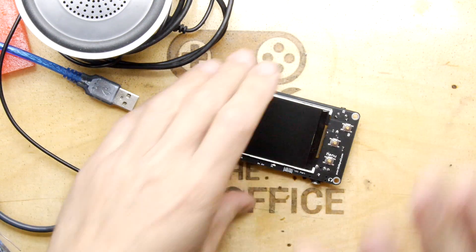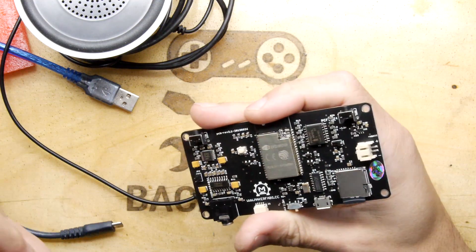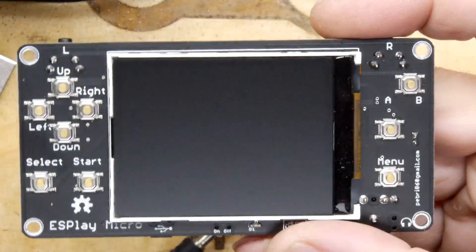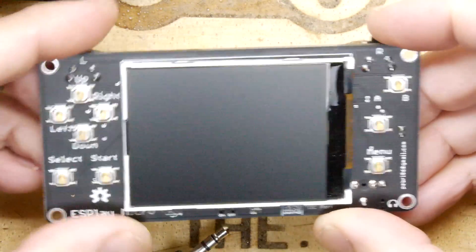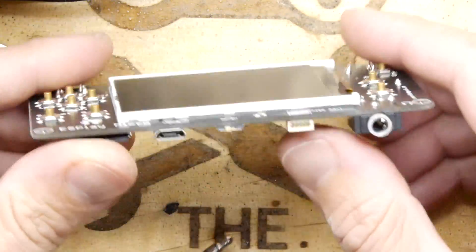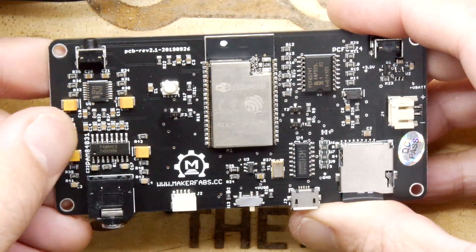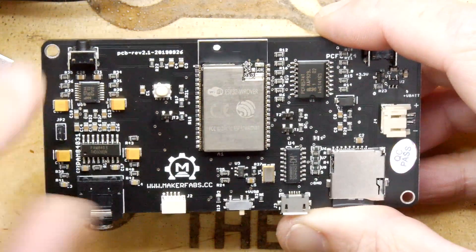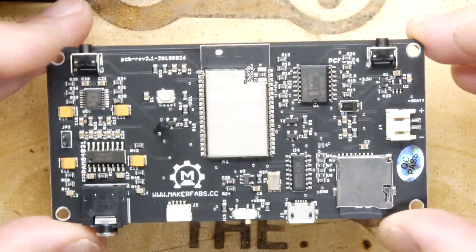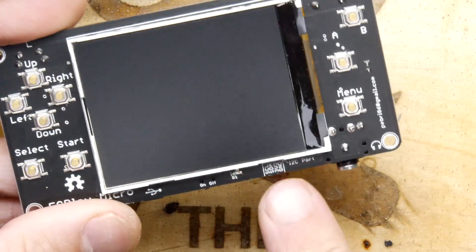I think it would need a lot more time to go through properly and assess it — I'm purely assessing it from a hardware perspective. It's got a good screen, good feeling buttons, a battery charger, comes with an SD card, and games ready to go. There are shoulder buttons on top which could be useful. You've got an on/off slider switch, USB for charging, an I2C port for external projects, a reset button, a couple of pin headers — JP2 I suspect is speaker out — and a battery connector.